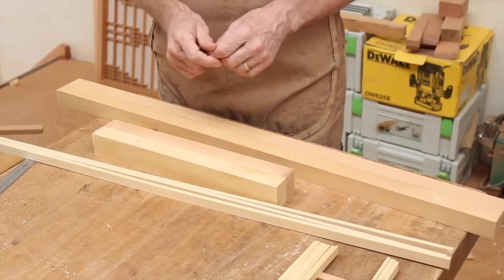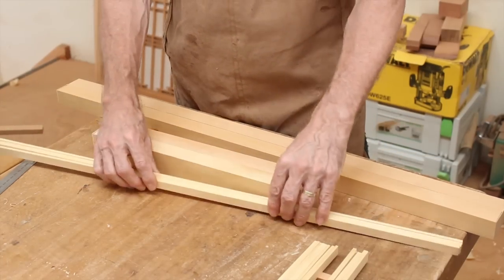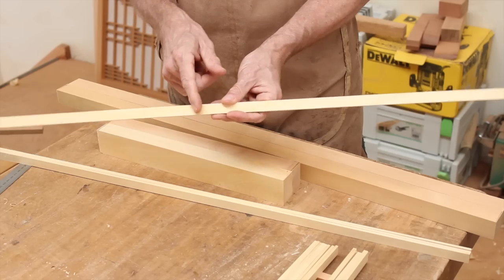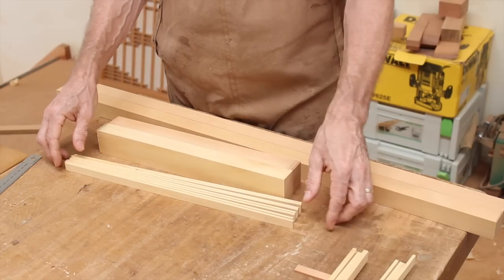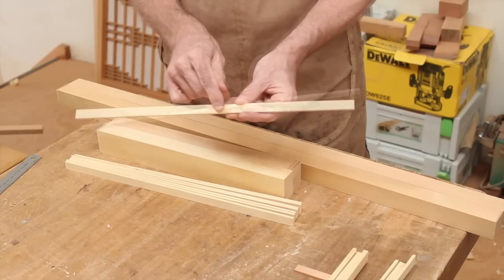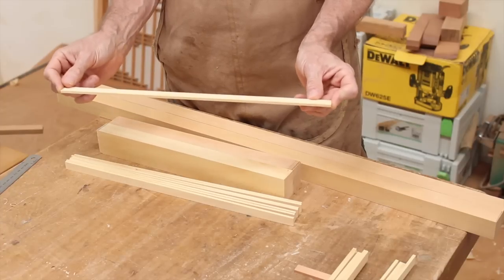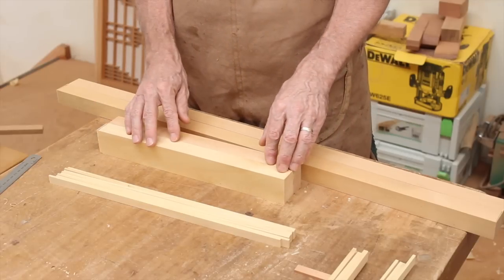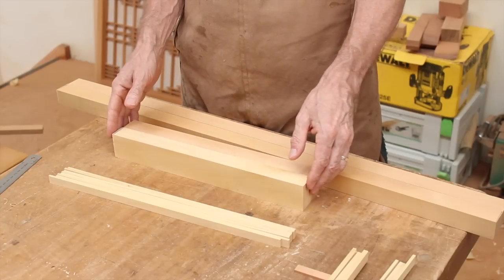One of these will be cut in half for the 2 horizontal tsukeko. We need at least 3 vertical kumiko with a mitsuke of 4mm, mikomi of 15mm and about 700mm long. We also need at least 5 horizontal kumiko with a mitsuke of 4mm, mikomi of 14mm and about 330mm long. All these timber dimensions are shown down in the information section below. That's all the timber we need, but it's probably wise to make up a few extra kumiko in particular